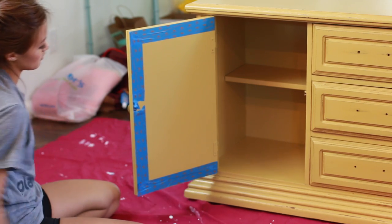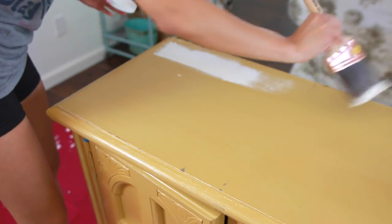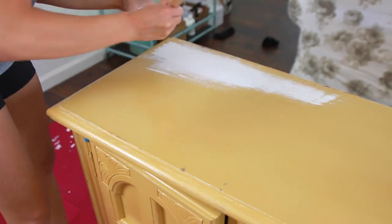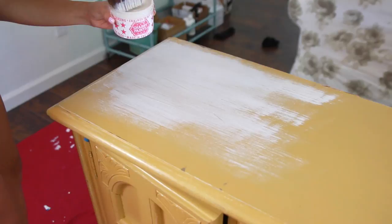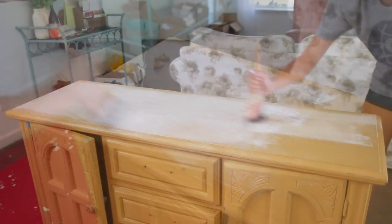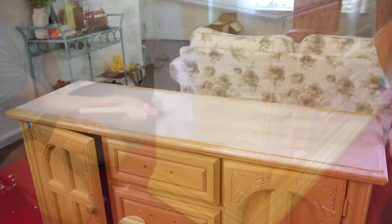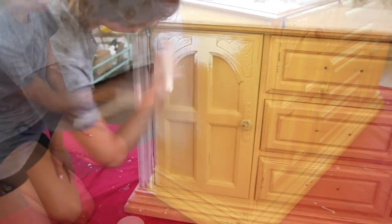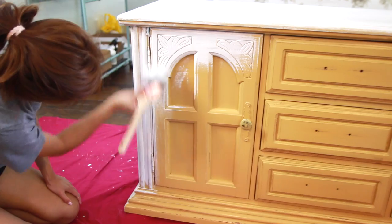Once I got that down, it's time to paint. I'm gonna shake up my paint and dip my brush in there very lightly because you want to use a very small amount since chalk paint is very dense. It dries really quickly so move fast. You're going to need two layers of paint to make it look nice and opaque, so don't worry too much about the first layer not looking perfect. I would highly recommend getting a smaller brush for detailing — you can see that little detail there, it just made it harder because I didn't get a smaller brush.